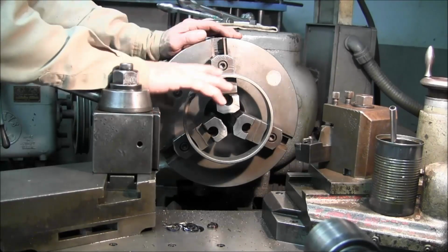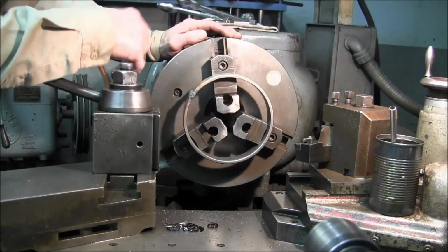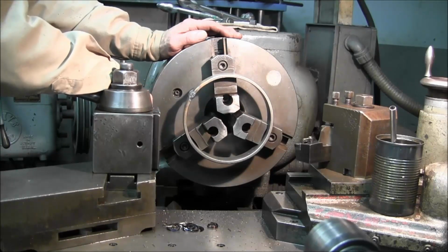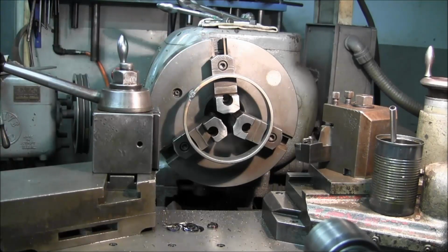And then I'm going to set these off to the side because I want to set up the shaft with the impeller. And we got a broach of keyway in the impeller because that's where I left off on that project last year. And we're going to be picking up on that, and we're going to get this pump together.